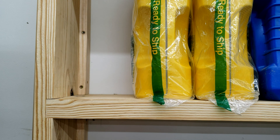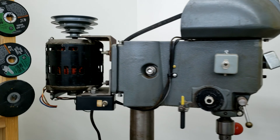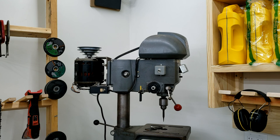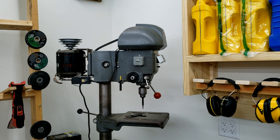I know there's all kinds of storage rack ideas like this on the internet, but I'm very pleased with how this one came out and it wasn't terribly complicated. You don't have to bother with doing the cuts with a dado blade, which we didn't actually have — we just used a regular blade. You don't have to rip the faces of the 2x10s, so you could get away with a circular saw and a drill if that's all you've got. We sized the shelves based on 5-quart jugs of oil because that was probably the biggest thing I expected to have up there, and it was just about the perfect depth when you get a 2x10. If you're looking for an idea like this, I'm very happy with how it turned out.